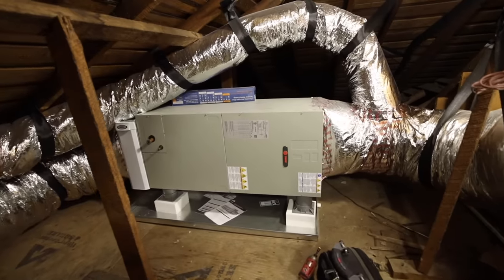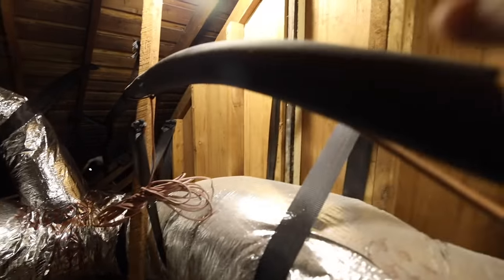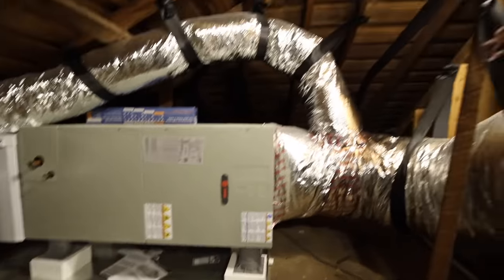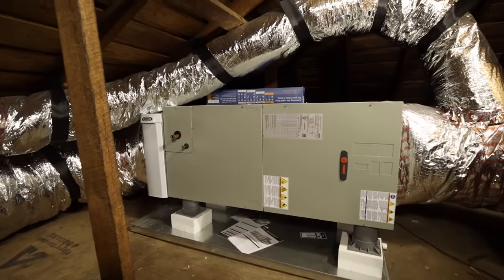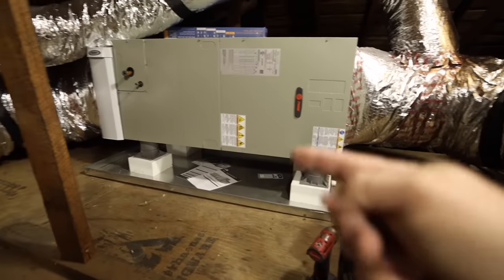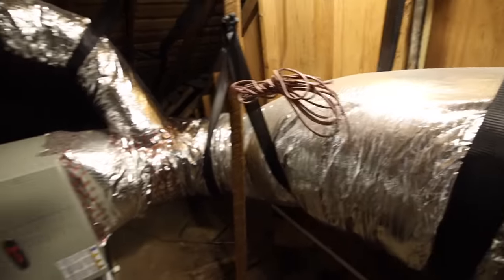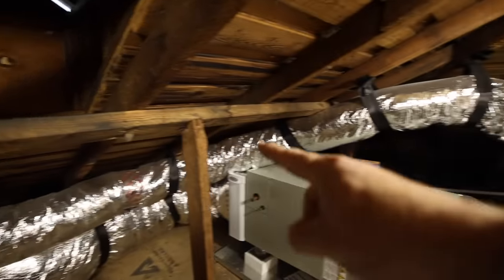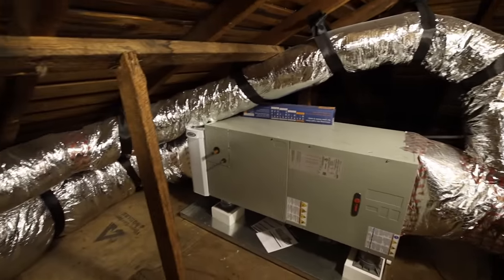So this is what we're working with today — a three and a half ton Trane air handler. Everything comes from over there. We've got the line set here, the drain lines down there, so that'll just come straight across. The line set I'm going to bend from up there, over, and then down and go in. That way it keeps everything nice and clean and accessible on the front. Just need to put a couple of safeties — one in the pan, one in the coil itself for the drain. Hook up all the low volt wiring here, and the high voltage is going to come out of this box here. I'll run that straight across, probably come up and then straight down, so it's nice and clean.